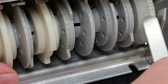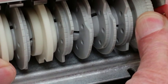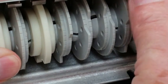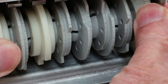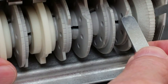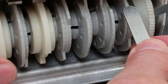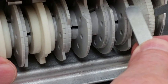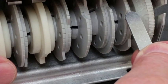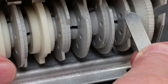When that happens, the motor stops and allows air to come up out of the sump. Then, once water is back in the machine — depending on your water pressure — we bring the back end of the cam forward. When the finger comes back up on top, the motor starts again. We want that to happen when the tank is approximately three-quarters full, so the pump will not cavitate.